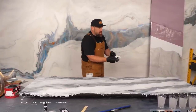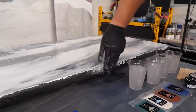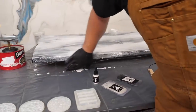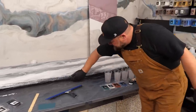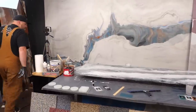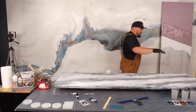I'm going to quickly get rid of the air. This is a good time to rub your edges out, because once that epoxy flows it's going to continue going where it's already been wetted down. This is a rock face project I created over three-quarter-inch MDF with a drop edge. I took a metal fiber sanding disc on a grinder and contoured the edge to look like chiseled stone, then slapped some Bondo on for fine detail, sanded it smooth. We have tutorials on the YouTube channel that show you how to do all of this.